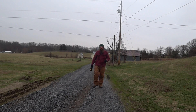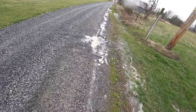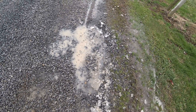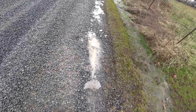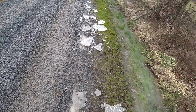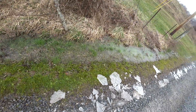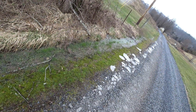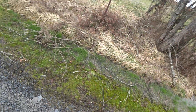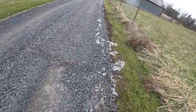This is something you don't see in a lot of people's videos — having to walk back and get all the cameras. It takes forever. That worked out pretty good. I'm walking back here on the gravel that we just cut. This pothole here was pretty deep and it's still there — I may have to take a little more work on it, maybe get the shovel out. With these up through here, they are just about gone; once I make another pass with the gravel I think they'll fill right in. There's a lot of ice down in there as well. There's also a drainage issue down here — you can see the standing water on the side; it's here all the time. This is part of the land I don't own, but eventually I hope to. I hate to put money into it, but it needs some French drains put down through here. I'll make another pass on this same side coming back and see if that can get a lot of these potholes filled the rest of the way in.